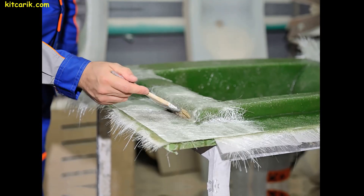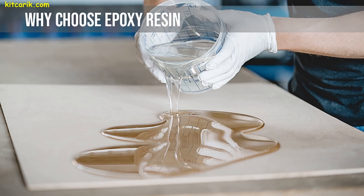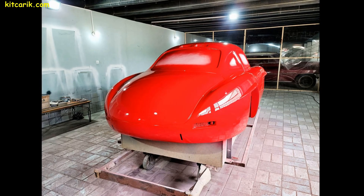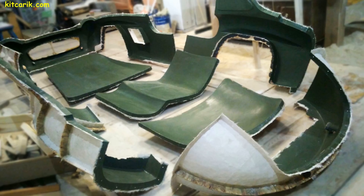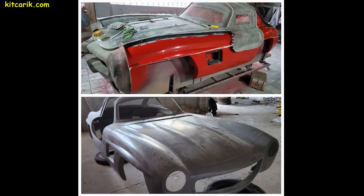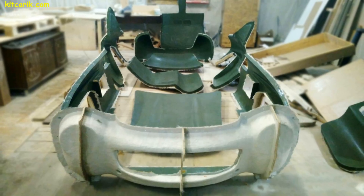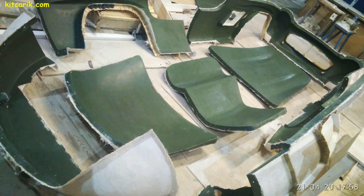Before making the fiberglass molds, we need to prepare the surface of the layout and protect it from adhesion. If you don't cover the layout with epoxy resin, varnish, or any other suitable substance, the fiberglass molds will stick to the layout and you will have to tear off the putty — and most importantly, this can corrode the layout and ruin it. Fiberglass mold making is not a complicated process; in further videos we will clearly demonstrate how to do this using other cars as an example and how much material is needed. It is better to make fiberglass molds for each detail separately, so that if you break a detail in the future, you can simply make a new one from those molds.